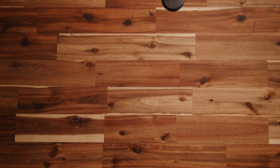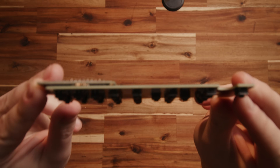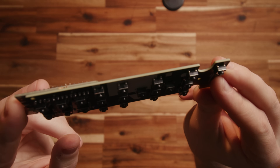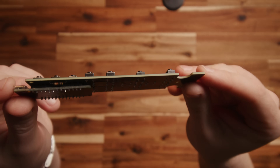My idea to solve this was to replace the topper with a PCB. PCBs are made from essentially fiberglass, which is weatherproof, and we can use the PCB for carrying power and signals between the strings instead of having to join wires together. It doesn't technically reduce the solder joints required, but if you've done any soldering, you'd know that joining wires to solder pads is worlds faster and easier than wire-to-wire.